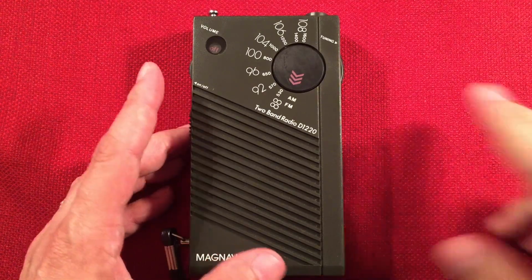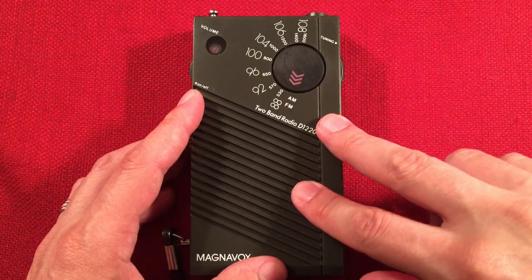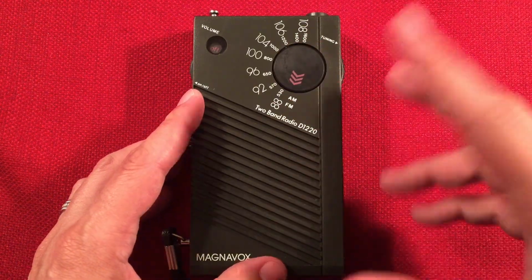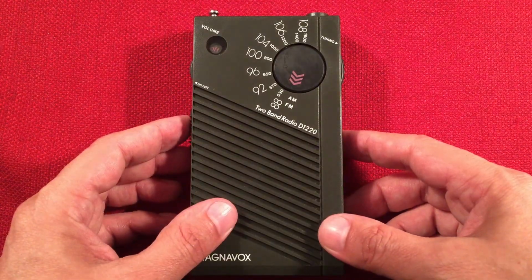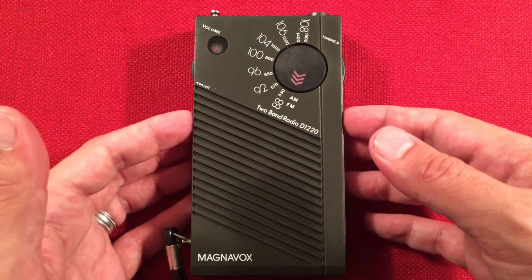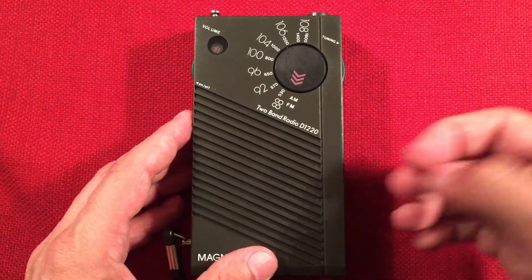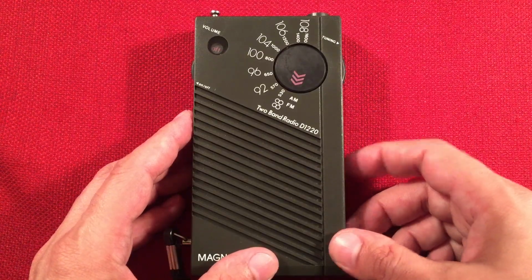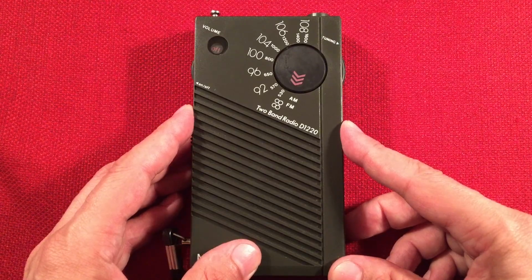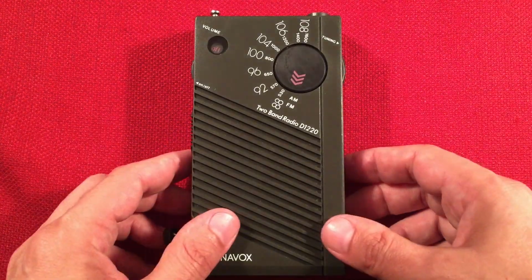That's the average I find with a good analog radio. So this is about a 2-star rating, just a little bit below average on sensitivity. The selectivity is fair to okay. Just difficult time grabbing stations. I can only get the strongest ones, the weak ones or the semi-weak ones. They fade in and out too much. I can't get a good lock on them. So selectivity is hard because you can't tell what station you're on. It kind of drifts. So this is good for mainly strong local stations only. So keep that in mind.